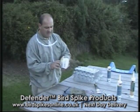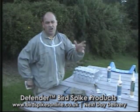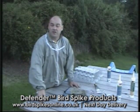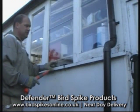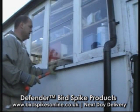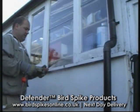You can pick up these from any hardware store and it will just stop you breathing in any dust. But as I'll show you in a minute, what I simply do is just damp down the surface first of all so that there is no dust. Here we're going to spike this window ledge, along here. First thing to do, of course, is just to make sure that the ledge is clean and free of droppings.